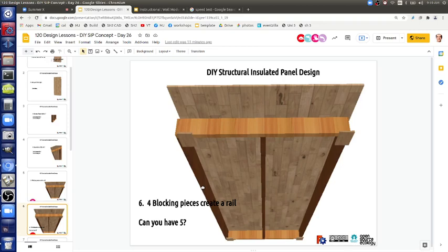Martin. So, question. Right now the tabs are like a projection. They're aligned with the panel. If we offset the tabs to the left, so if we move every tab over by an inch and a half, when you walk up with your panel, you could set the butt of it in next to your adjacent panel on, say, the left side as we're viewing it, and then set it up. That allows the panel to slip past the other panel that's sticking out, so the outside panels are in alignment, and then the tabs on the left side would hit the stud on the left, keeping you from pushing it over. So you could just put in the butt, lift it up and align it, and everything slots in place. Because yesterday when we put it in, we had to put it on the rail and pound it over, right? And this would allow you to set it in, lift it up, and make some minor adjustments. Am I describing this well?